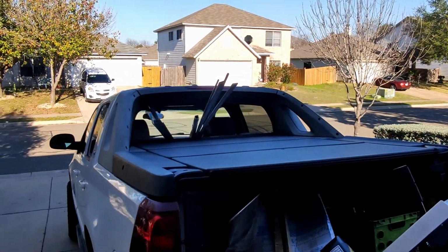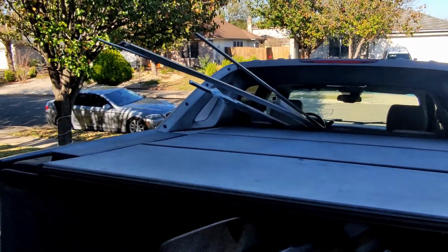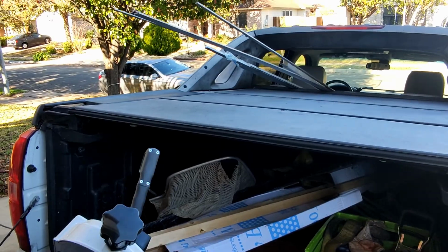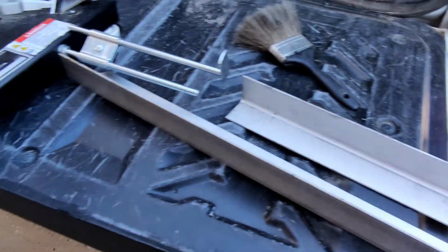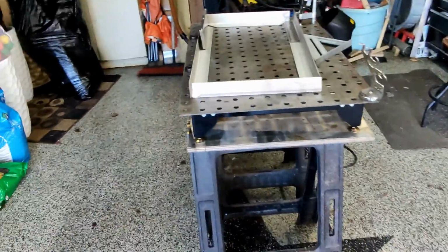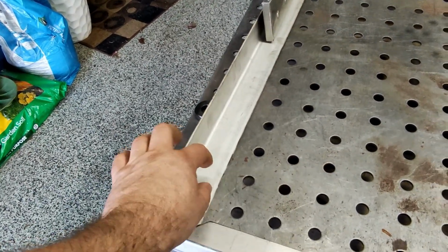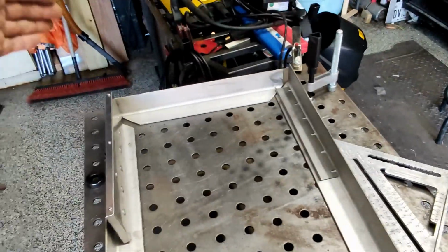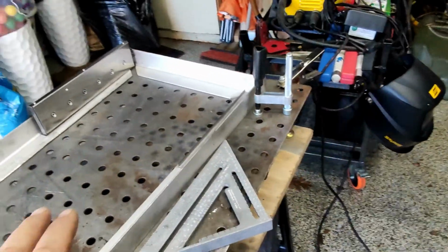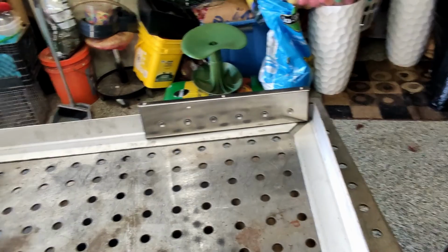Went to the supplier today, bought some stainless steel. I paid close to $600 for that steel. This is 2-inch angle. So basically, the bricks are gonna stand in here. I'm gonna make them 1.5, close to 2-inch thick, and then they stand basically upright in here. The bottom box, here I gotta make a channel to make the motor go up and down so I can lower the shish kebabs or the roast very close to the coal if I want to.